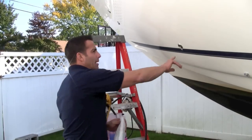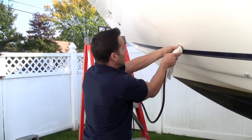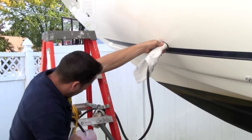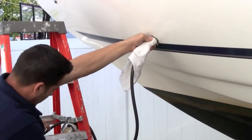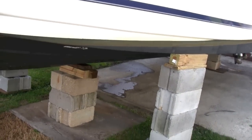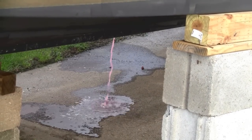I'm over by the front of my boat where my outlet is and I'm going to be putting the hose from my pump in there. I just got a rag around here to make it a little tighter so it doesn't spit all over the place. Simply what I'm going to do is turn it on — it's inside the antifreeze bucket and we're going to see it coming out the bottom over there. That's all we have to do. Once it's on, it's pumping through and you start to see the water coming out, until you see the pink — then you know it's all the way through. That looks pretty pink to me.